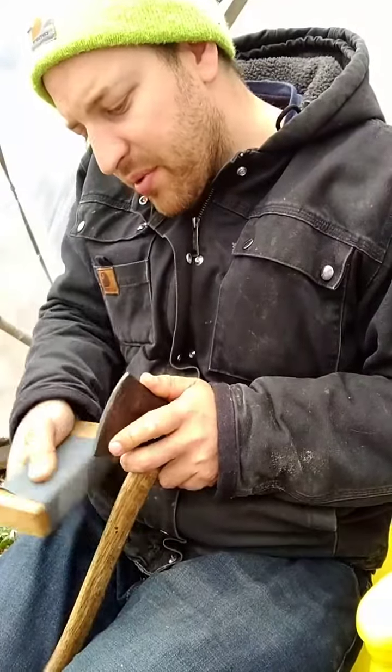Right. Now, when you file this Scandi bevel on, for instance, this Baco axe came completely dull, which in some cases, at first I was like, I can't use it at all. I have to do stuff to it before I can use it. But it's kind of smart, because this Prandi axe came with an edge, it's sharp, but there's no bevel. And so I'm probably not going to do anything about it until it gets dull, which, quite frankly, isn't as helpful as having a bevel. So by leaving it totally dull, it sort of forced me to make the choice of how I wanted to have it be and then make it that way before I had a usable tool, which I can appreciate the logic behind.